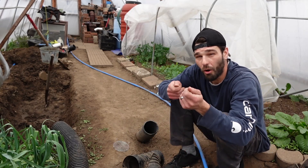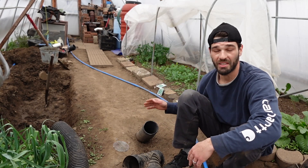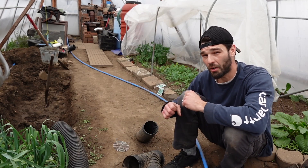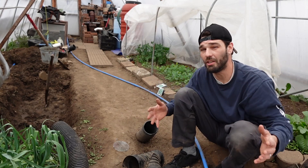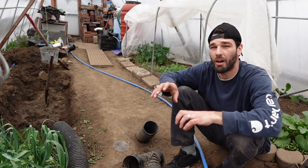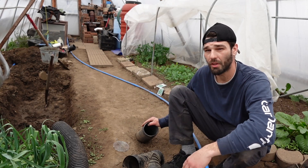We had to create our own system to get down in there since it wasn't a straight shot. I didn't want to use a drain snake because of the metal tippets — I didn't want to break the tubing. I used PVC with towels, pulled them out, wrung them out, did that about 15-20 times. I also used a pump when I first started and pumped maybe five to seven gallons out. After a few weeks of drying, we are now 100% flow again.